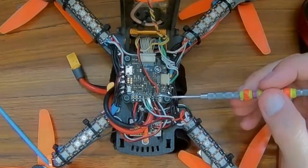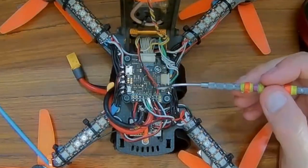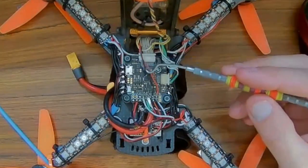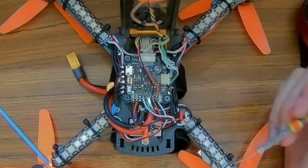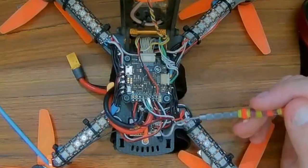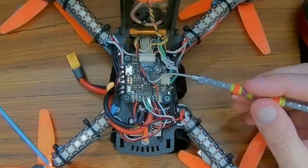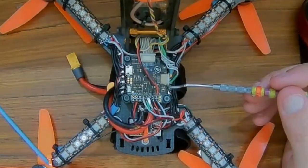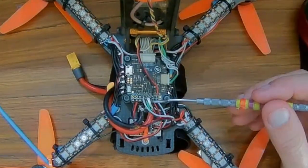And then LED, like I said, is the normal LED pad. And as long as you run the resource command, you have to say LED strip A08. You have to set the resource to that so it'll work. Otherwise, your LEDs won't power on. So it's pretty simple once you know actually how to do it and which UART to use. So for this Hobbywing stack, this is the G2, the newer one that comes with the 45 amp ESCs in the stack, you have to use UART3. Didn't work for me on UART1, only on UART3.